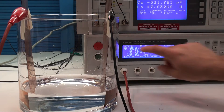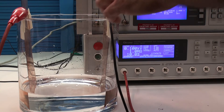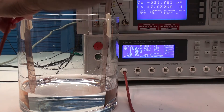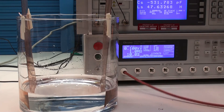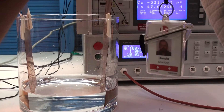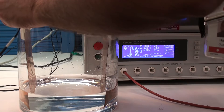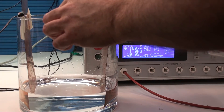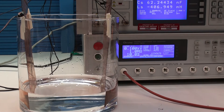Now we're doing a 100-volt IR test. This was just with distilled water added — one liter — and we crowbarred the machine. It was showing approximately less than 100 kilohms, which is approximately what the reading is. What I'm hooking up now is the LCR 7600, and I'm going to reconfigure the device and set this up for series resistance and series capacitance, and take a reading to see what the water looks like with just the plates.